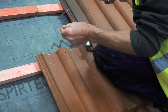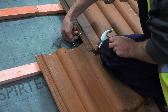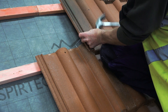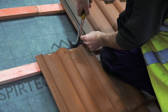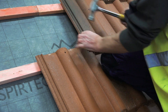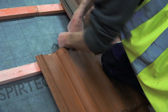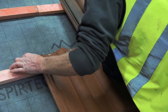Here's another clip that is commonly used — this one is an all-in-one clip. You don't have a loose nail; you simply position the edge of the clip onto the tile, then knock the clip down into the batten. Once you get used to it, it's probably not a bad little system, but I'm finding it difficult to find the exact point on the batten where the nail goes in, because ideally it should go into the middle of the batten.